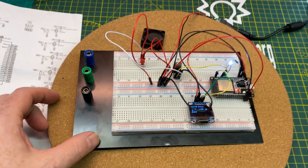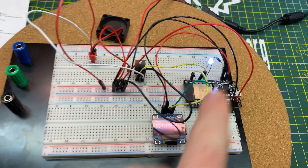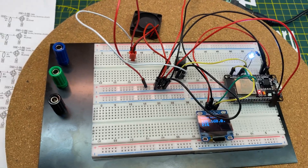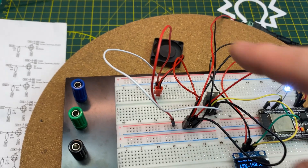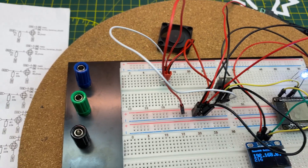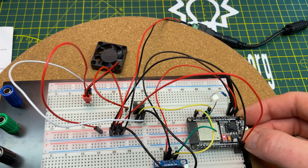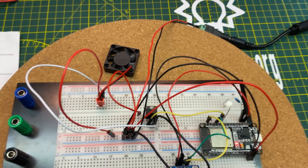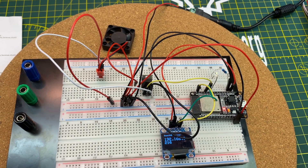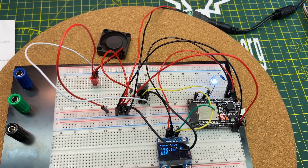Another day later and I'm still working on this project - made some progress. I've got the web side of it all working and I can command that LED. I wired up the first MOSFET to the fan and paralleled it with the LED. It's on the correct pin, and if I put the ESP into reset you can see the GPIO goes out, LED goes out, and once it goes through the setup portion of the sketch it initiates high.